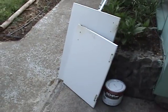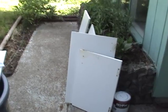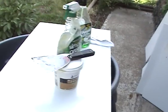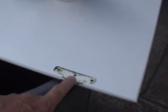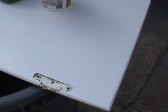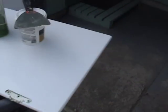The first thing you want to do when you do any kind of cabinets is mark them somehow. If you notice, there are four different cabinet doors right there and I'm not sure where they go, but they could all be custom fit to their own cabinets. After you get them painted they even look different. So you want to mark cabinet one, maybe on the hinge where you're not going to paint because the hinge will cover it, or somewhere you can tell which one went where.